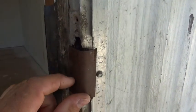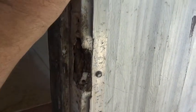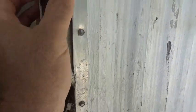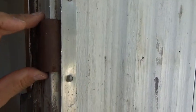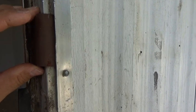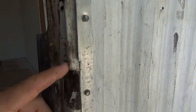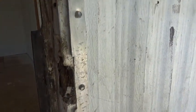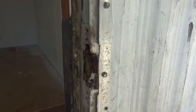We will have to drill our hole out for our plunger for our door, and we will have to drill our hole out for our plunger for our deadbolt. That should do it and it is going to be a lot tougher to kick out. It is not going to be this flimsy aluminum and wood — it is going to be steel mounted with some big screws screwing it down to this stud here.